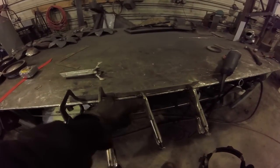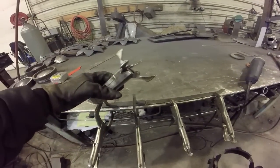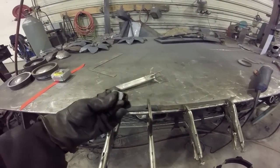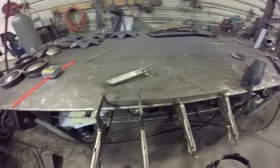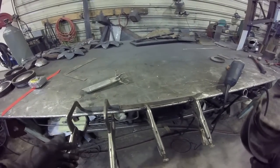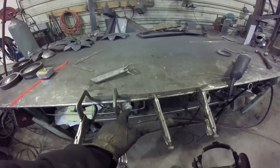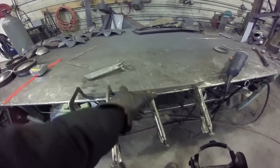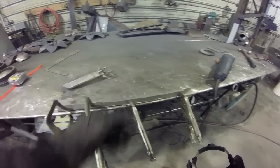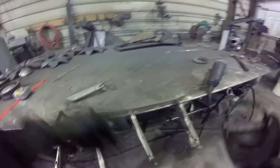I have to add an extension of mild steel to the blade tang. The tang already goes into the handle a little ways, but in order to go all the way through and weld into the back cap to attach it solidly, it has to be extended. The piece that I cut it out of wasn't long enough or wide enough to cut the full-length blade. But this should work fine — this will be a weak point, but it'll also be welded up here and in the back, so it would take a lot of force to break it in the middle.